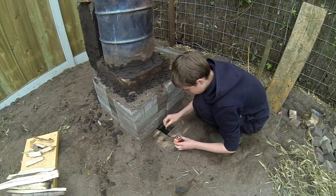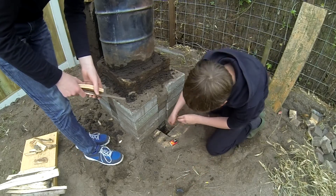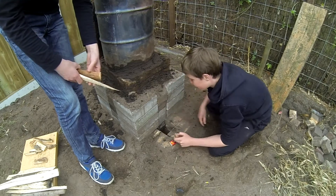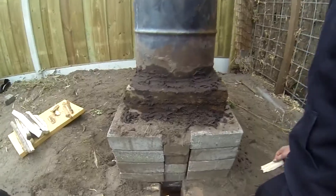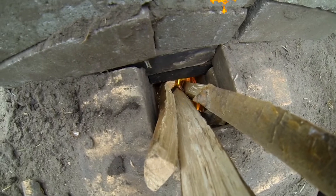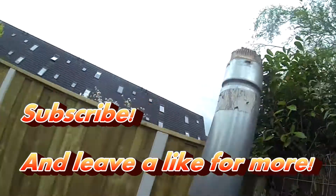The final test: we lit a fire lighter and put one far into the burning chamber to create a draft. We first put one far back in the chimney and then another one just in front of it. Three minutes later you can already see the draft. About ten minutes later it's properly heated — no smoke, as you can see. And we contain the heat.